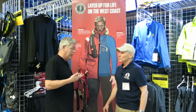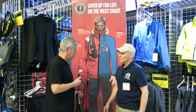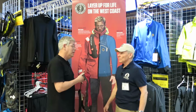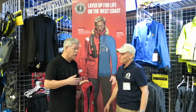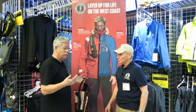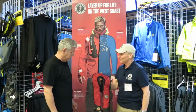In time of emergency, we don't want to get knocked out, but if we do pass out, this acts just like a life jacket as opposed to a PFD. It's PFD rated, but it acts just like a life jacket. The difference is, a PFD will float you, but you need to be conscious, or you may end up face forward. Good point. A life jacket keeps our airway open and keeps us floating upright, face up in the water, regardless of being conscious or not. So that's really the difference. Well, let's set it off, and then we'll do the rearming. Absolutely. Thanks again. I appreciate it.